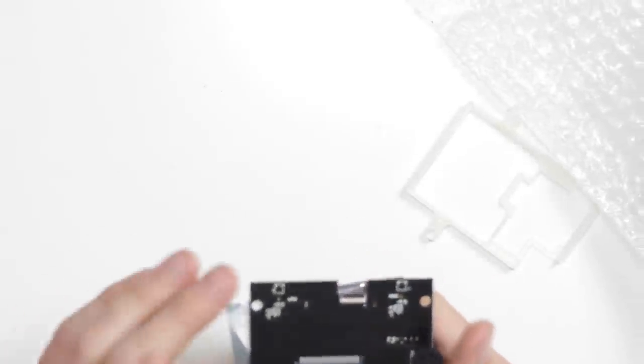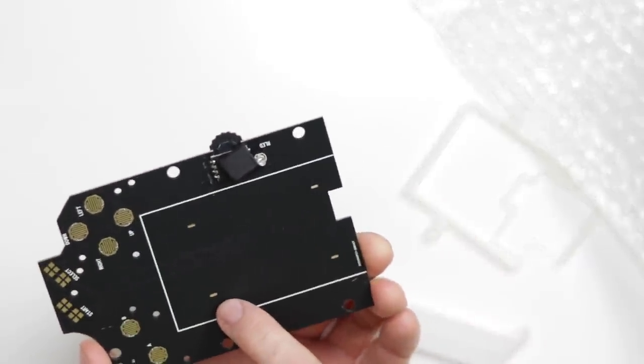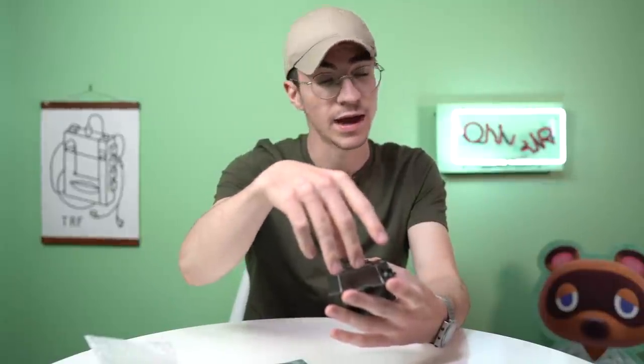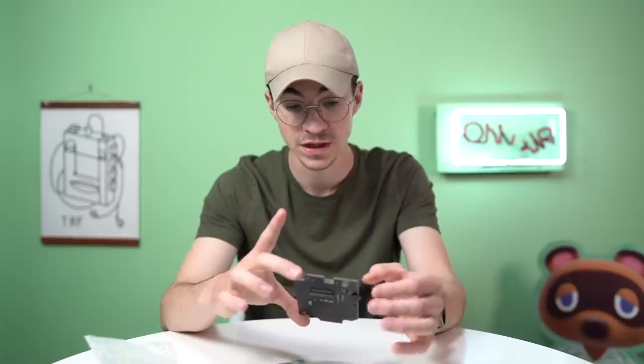The other thing is that the pre-built kit from Retro Modding was misaligned — and that was not down to Retro Modding. What that was down to was the misalignment of these little grooves and cut-out through-holes here, which line up with the back of the IPS screen so the whole thing will be centered. But that didn't actually happen. So this is a new revision and I'm very excited to see how well it performs.